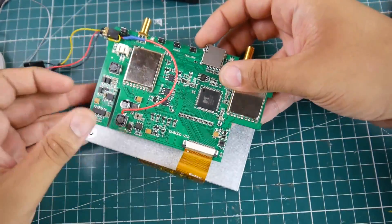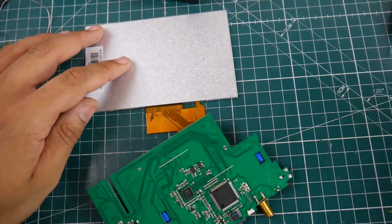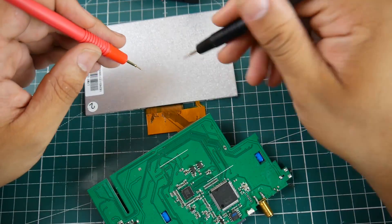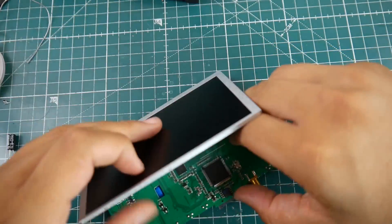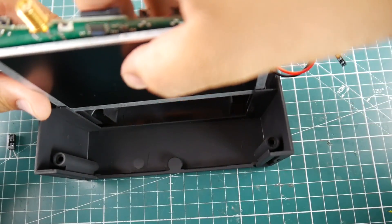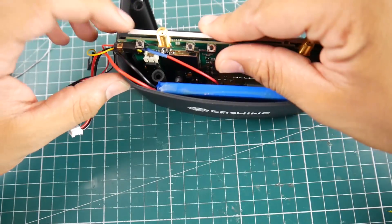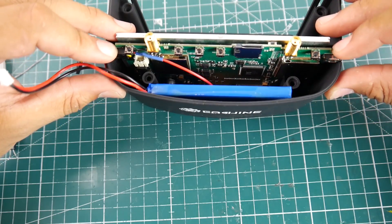What we want to do is flip them together like so. Be careful not to plug in the battery — this thing is absolutely conductive. If something touches the circuit on the backside here, it'll short circuit. That's conductive, so take that into consideration. Make sure the battery is out. Bring it in and install it like so. Make sure we align the board, and we don't really have to worry about wire routing because you're going through the AV-in right there.